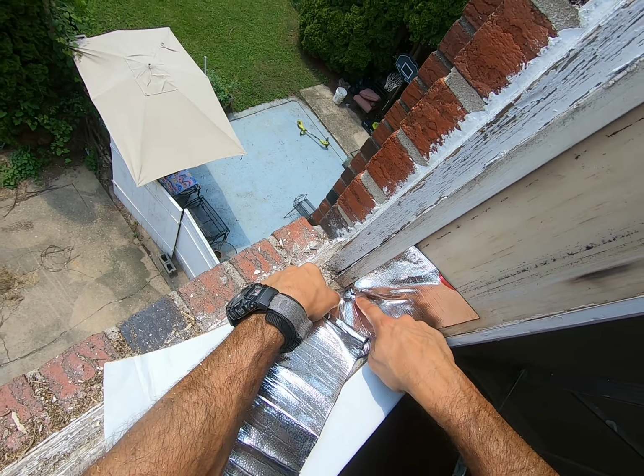If this really bothers you, then I would probably recommend drilling a hole here and another hole here, and then, you know, the water will go under. But if you have this skirt installed, well, then the water is actually just gonna sit down here. So I would rather have the water sit here and air dry, and it'll be fine. The second difference is, with the Pella windows, the bottom right here is not flat, it's also tilted out. And I feel like this one is just pretty flat. It does sit a little lower than this back here, but again, minor differences. Other than that, guys, everything is pretty much the same.